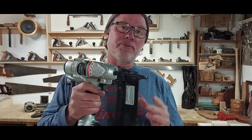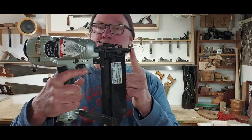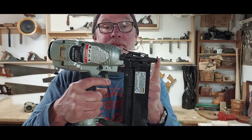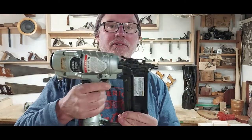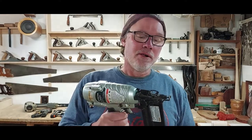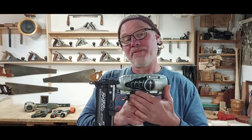This gun has a nice feature that prevents bump firing. Bump firing is when you go to shoot your material, pull the trigger, the gun goes back and hits something, bounces back to touch the material again, and fires again without you even taking your finger off the trigger. This gun won't do that — you have to take your finger off the trigger, then depress it again. It's a good thing because bump firing happens more often than you think. You can take this feature off so it will fire repeatedly, but I would keep whatever safety they have on these guns. Don't take those off — they will bump fire and it can get scary.